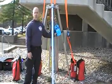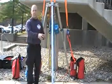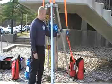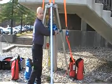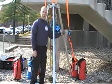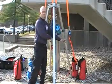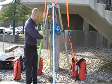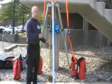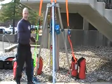We also have here what's called a Kootenai pulley, or a knot-passing pulley — it's nice and wide so we can fit our air lines and communication lines through it. I wrapped some prusik cord around the leg of the tripod and connected it to the Kootenai pulley with a carabiner to pull it back a bit. I also left a nice loop to feed those lines through, because it pulls everything away from the hole and the entry point. You want to keep that clutter-free and open so there are no entanglement hazards when the rescuer and victim are coming out. If you're not using it, pull it away and keep it out of the way.